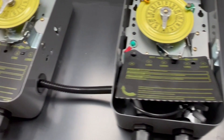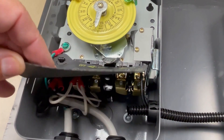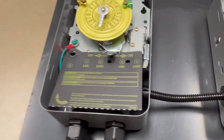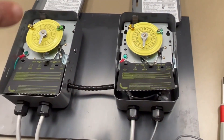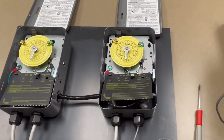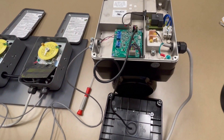On the other clock, the black lead wired in is 3450 RPM, so now both are wired in at the speeds based on the devices they're connected to and the speeds they need to run at when they come on. At this point we will power up the motor and let it run through its prime speed.